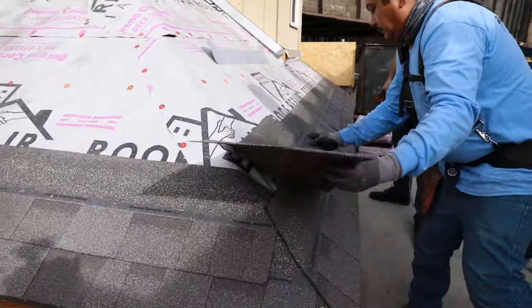Now that we've come to the rake, I want to show you how to properly cut and place shingles here. This is our finished edge and we've got our shingles pre-cut. As mentioned before, always make sure your cut edge goes on the inside and not the outside — we can never get a perfectly straight line like a factory edge, so the cut edge goes on the inside and the clean edge faces out. We're aligning these properly and ready to install. Being that this is a smaller shingle, we don't need four nails — it's slightly more than 12 inches, so I'm adding one nail right in the middle.